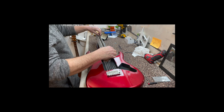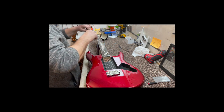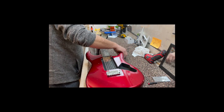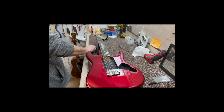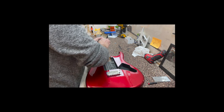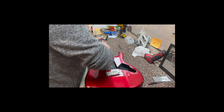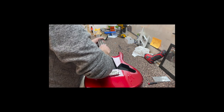Okay, so I'm going to calibrate the StewMac U channel file. I've got the rosewood insert that I cut and shaped to fill in Andy's acoustic bridge over there, for filling the saddle slot. So I've got that inserted and glued and clamped and setting. And once that's done, I'll have to figure a way to mark up the new bridge saddle going in a new direction. I'll be able to reproduce the angle pretty well. It's not that complicated to do, he said.